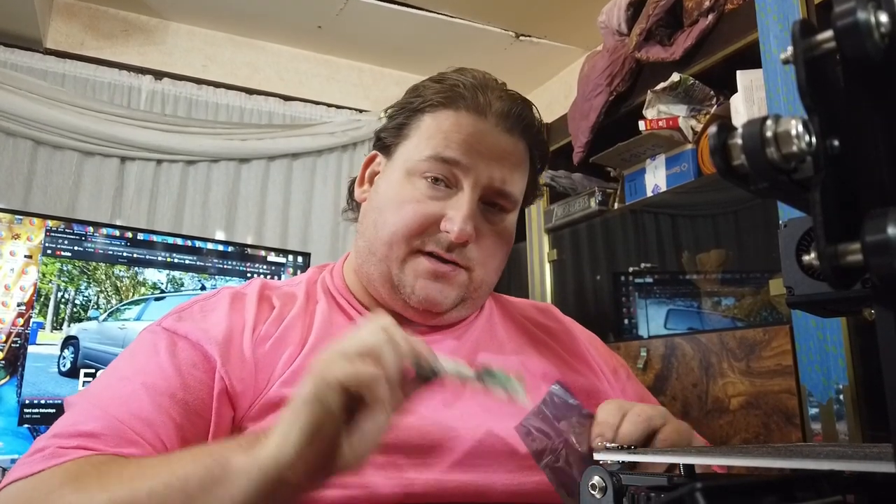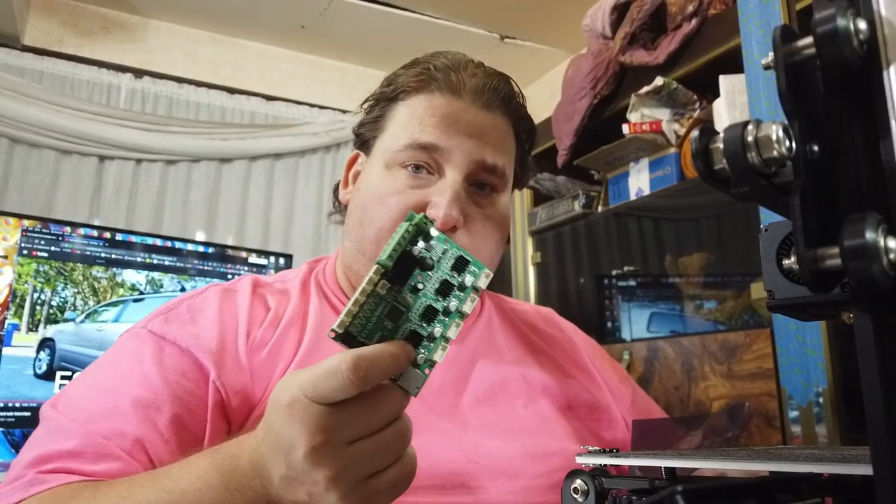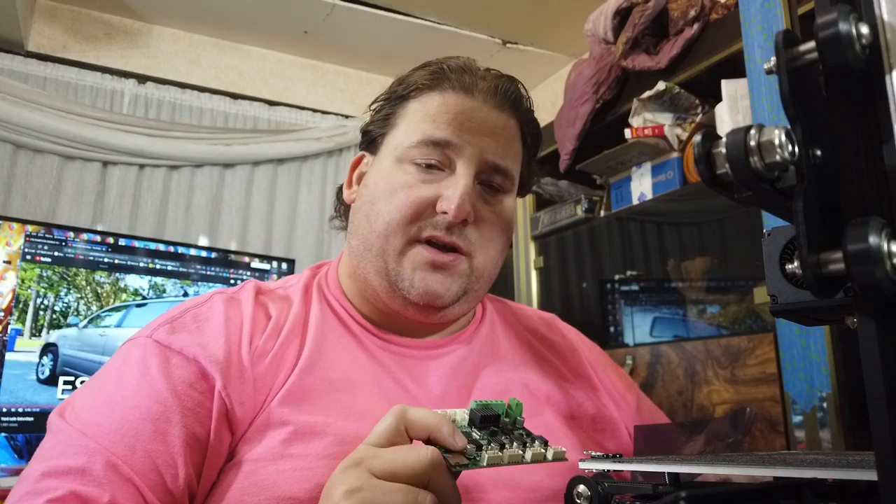The machine was new and something went wrong — it died. Creality sent replacement parts, no problems. First up is the brain board. We're going to install the brain board first since I'm pretty sure that is where the problem is coming from. If the LCD persists in being a problem I also have a replacement LCD. I'm now going to lift up the Z axis, move the bed out of the way, open up the brain box, and begin the process of moving the wires from the old brain board to the new one, then power it up after verifying there are no shorts or grounds anywhere they shouldn't be. Stay tuned.